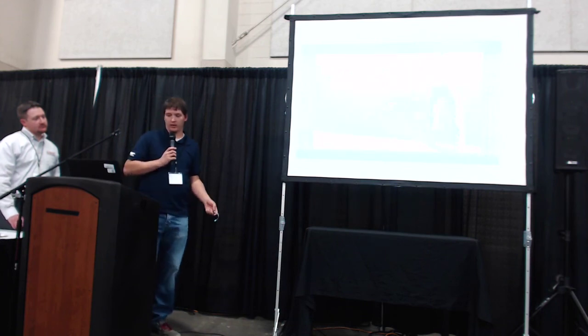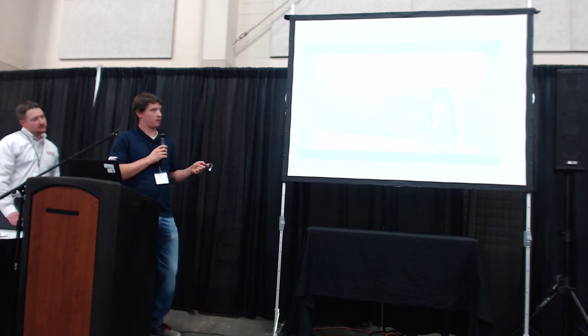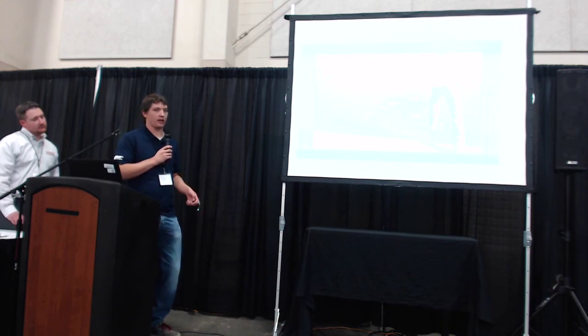Right here we took a picture of this. You can see that they made sure that they took care in replacing that sample area. They put some buckets there. He raked it out. After the rollers passed over this spot, if you went back an hour later, you couldn't tell that they sampled there. Great job in raking it out. Make sure there's not a segregated spot where we sampled.